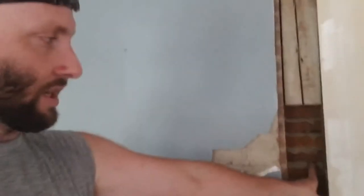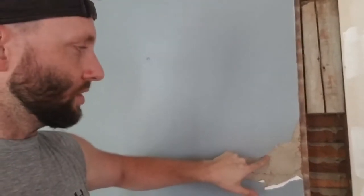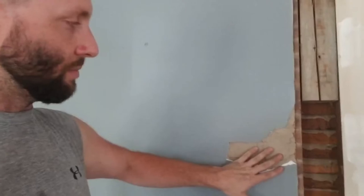Here you can see all of it together: this is the back side of the wall with the plaster smooshed through the lath, this is the skim coat — it's been painted — and this is a part that's cracked off. The skim coat is the fragile piece you see cracking on most plaster walls, and once it's exposed the base can get very crumbly.